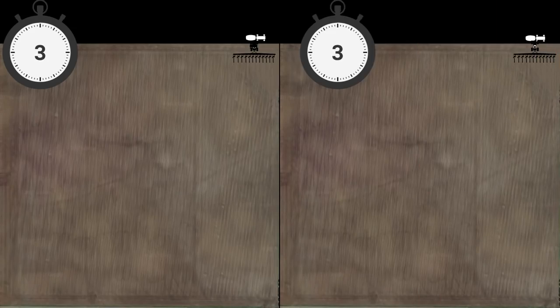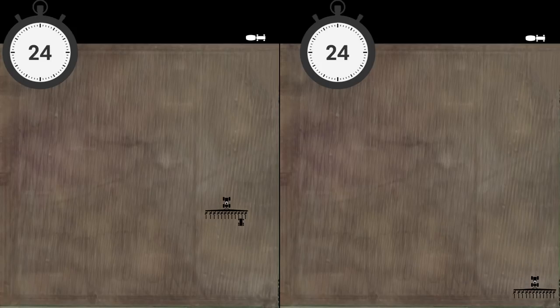Let me give you an example in an 80-acre field. For our operation, we're using 80 units of N, 40 on each side of the row, so it's 23 gallons to the acre. Let's use the 700-gallon tank size, which is pretty common in the industry.